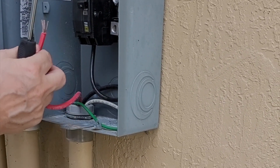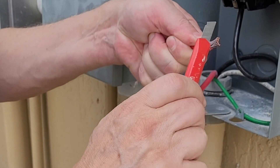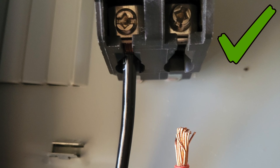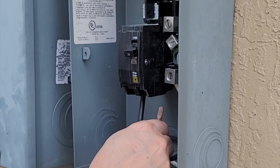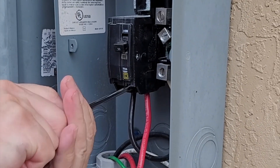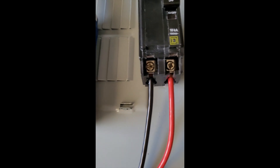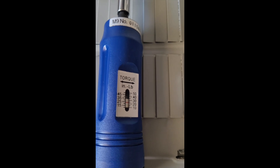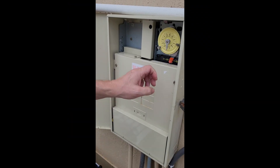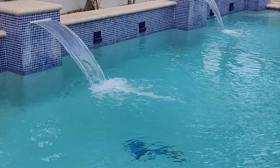We turn off the breaker and remove the red wire from the contact connection. Take a look — this wire is heavily oxidized. This must be the cause of the malfunction. Rather than simply stripping the wire, we recommend doing it correctly: cutting off the oxidized piece of wire, removing the insulation, and installing a new connection. When installing a wire into a breaker clamp connection, it is important to check the tightening torque. For an 8 AWG wire, this torque should be 25 inch-pounds, which is 2.82 Nm. We perform the torque test using a special measuring screwdriver. After completing the repair and closing all the panels, we turn on the breakers and start the motor — everything works great and nothing needs to be replaced in the system. This repair shows real money saving, thanks to the correct diagnostic.